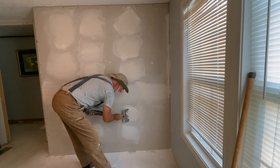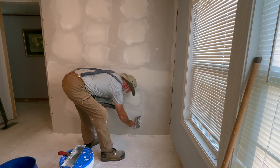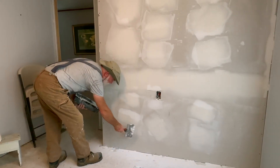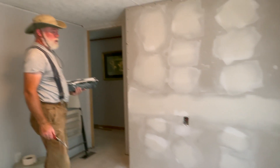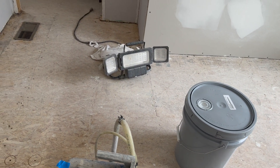And just because I'm already in the process, I'm going to go ahead and put mud on all the screw holes down below too, even though these will also be up behind the beadboard. That should be it — in theory that's going to give us a nice smooth wall. Now we're into the homestretch here in this small bedroom. The drywall is now up to a level four. We've got a bucket of paint, we've got the airless sprayer, I've got an extra light because we had to remove the light fixture. Bucket of water to get the sprayer going, the window is taped off. Looks like we're ready to start spraying paint up on the wall.